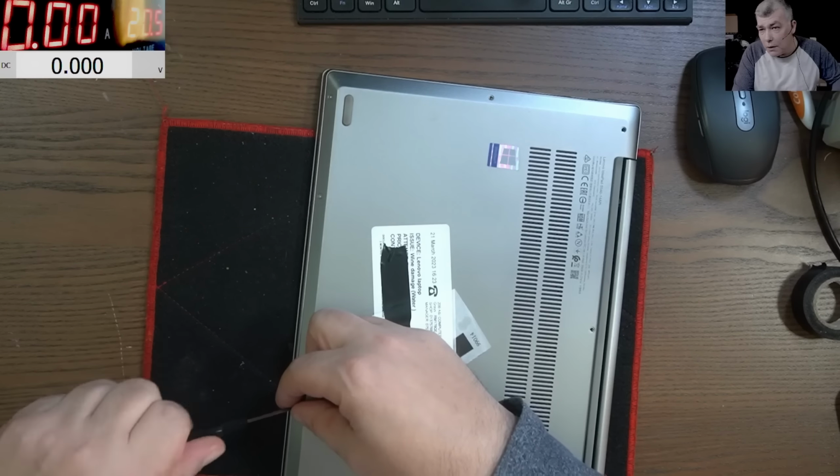But you have to let the customer know on a liquid damage job, the keyboard also is possible to be faulty. Because otherwise, you will have a surprise. You fix the laptop and you tell the customer, okay, I fixed the laptop, but you need a keyboard, and the keyboard is that much on top. And the customer will say, yeah, but we agreed together to a price when I gave you the laptop, and you told me that's the price for the laptop to be repaired. Now you tell me I have to pay extra. This kind of awkward dialogue, yeah? So tell the customer from before. Actually, it is possible there to be a dead keyboard.